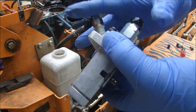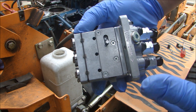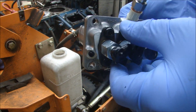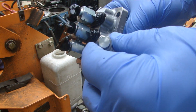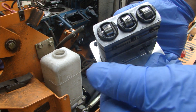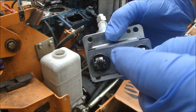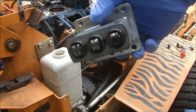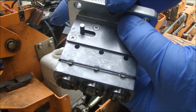Here's the new pump — brand new. They go for about $675, so it's pretty expensive. It comes with some caps on it just to protect the fuel fittings, and there are some different fittings so you have to swap the fittings from your old pump. I put a little grease on the rollers, and you can see they're all nice and firm — these are in great shape. So let's install this pump and get it ready for operation.